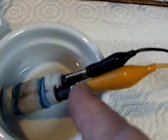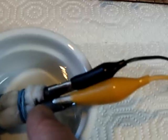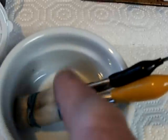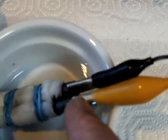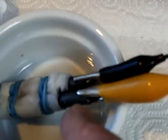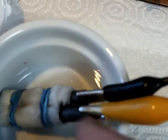Now, if you're going to do this, do yourself a favor: before you put a charge on it, take a reading with your multimeter and make absolutely sure you don't have any kind of galvanic cell formed between the tin coating on your clip lead and your carbon electrode. If there's a film of water and it's not a hard contact, you can develop a galvanic battery right there. That happened to me on one of the cells I was testing — it ate up the clip lead. The clip lead became the anode and the carbon became the cathode. So make really sure before you start charging that you have no galvanic situation going on.